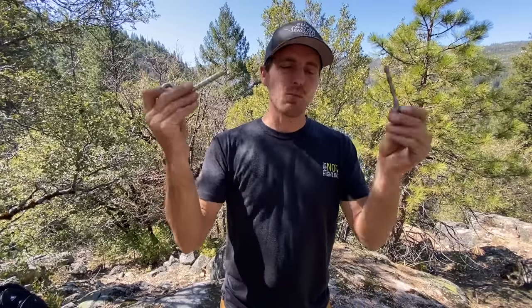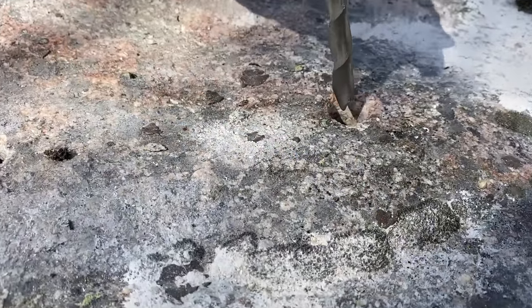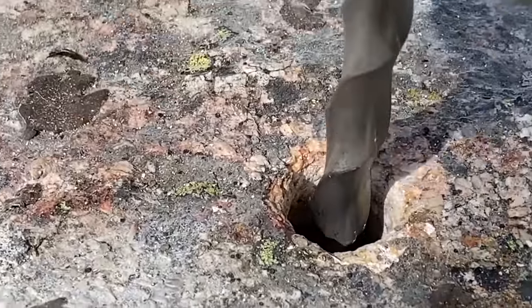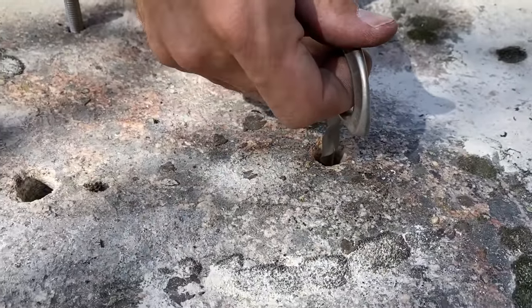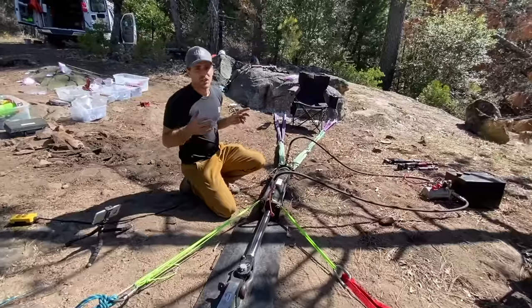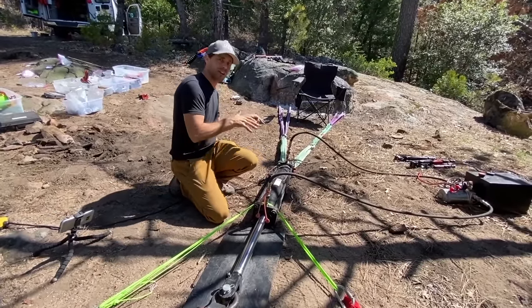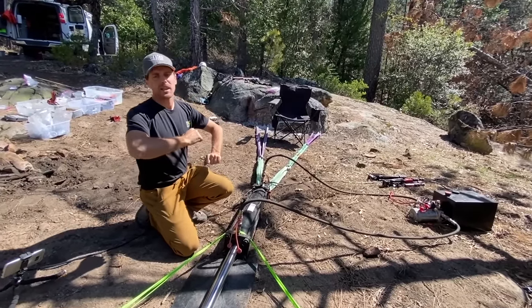But sometimes there are situations where you are either stuck using a bigger hole or you don't have any more of the small drill bits — it's never happened to us. It also could be because of a trick we're going to show you later on fixing mistakes. So there are plenty of reasons why this will happen and we're going to find out if it's dangerous. Here we are going to test in shear our Healy fix bolt, and you can see there is a lot of space around the bolt. This is the skinniest glue-in bolt we have for the biggest five-eighths inch bit we have. This is the hydraulic we're going to be pulling on that bolt. We have this to keep the hydraulic from flying when the bolt comes out, and we have that side anchored to that rock so we can pull and snap things in our dynamometer.